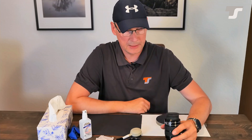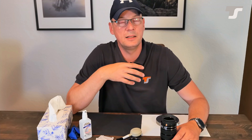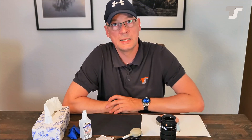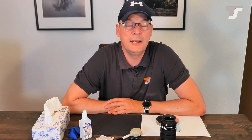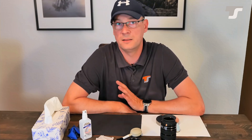That happens regularly, and especially for that kind of dirt you have to pay real attention. When you just have dust on the surface, maybe from over the day, this is not a real issue. But everything which is greasy may also contain light acid, and that can really damage the coating of the lens or the mirror. There is no fixed cleaning interval — you should clean an optic as rarely as possible. If there is only a little bit of dust, just don't clean it.